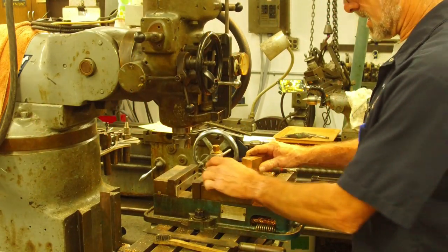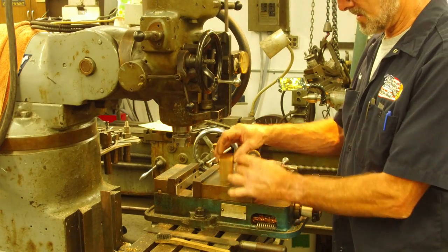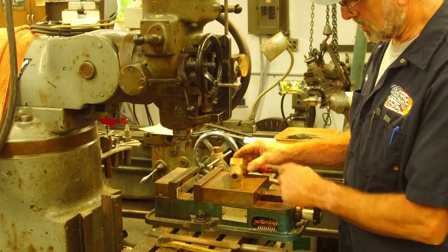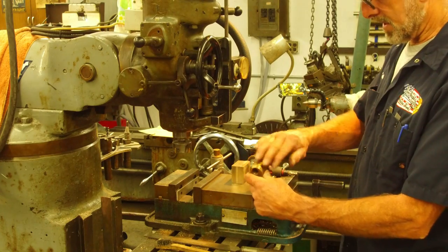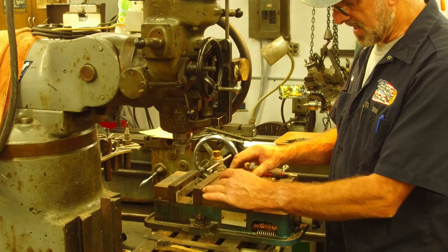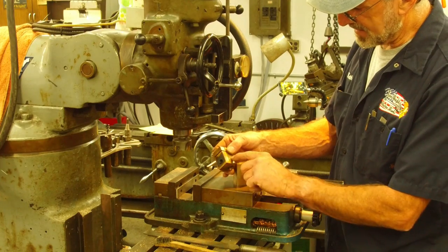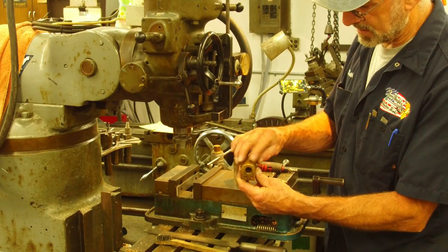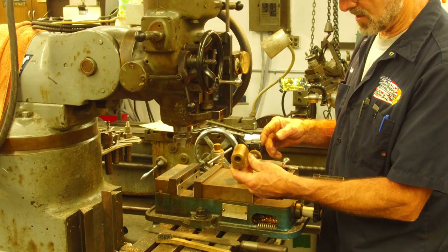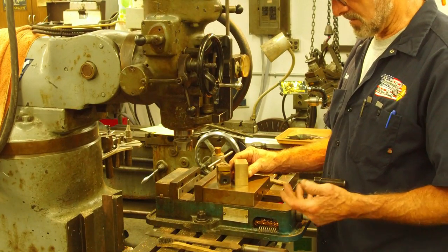We're starting off today. We've already roughed out kind of our height and our length. We left it a little bit long, and we are a little bit higher. We're going to put a radius, and we're putting the roundness on the bottom side of the nut. Right now, we're going to take down the thickness. And this is notched out because this basically was a cast product back in the day. So they squirted out a piece of bronze, and that's what they made the nut.